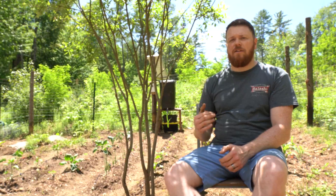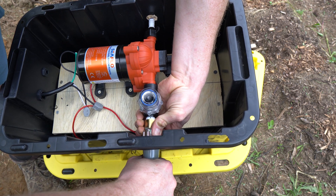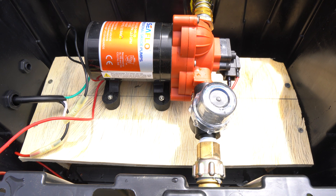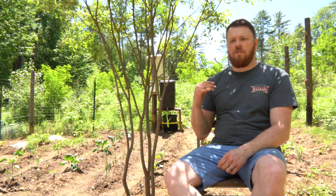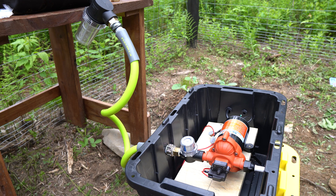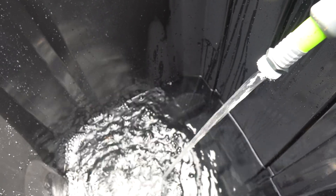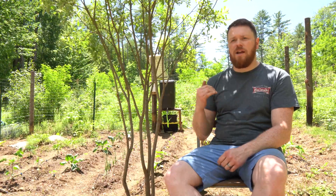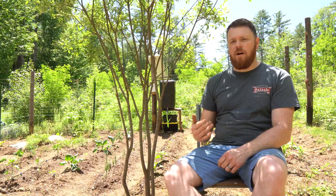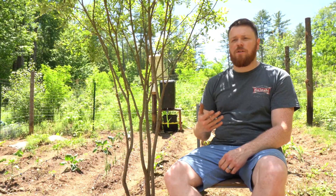Attached to the battery itself, I have cables up to a separate box that has a little water pump — I think C-Flow is the name of the company. There'll be a link in the description below where you can purchase it on Amazon. The battery gets charged by the solar panel, and then the battery is hooked up to the pump. That pump is a basic water pump. It senses pressure coming into it, and when it hits a certain amount of PSI, the pump turns on and pumps the water through into the irrigation system. It's an on-demand pump, so it's not just running consistently and constantly, especially if you have it hooked up to a timer.